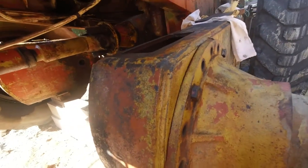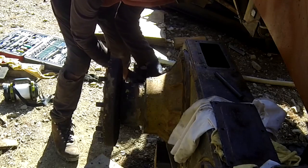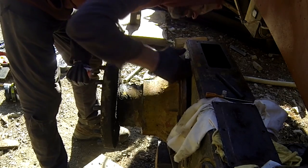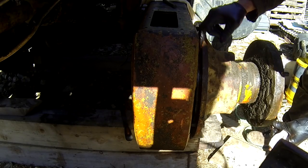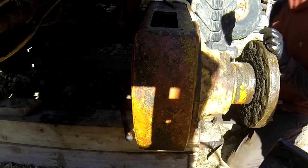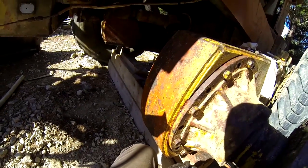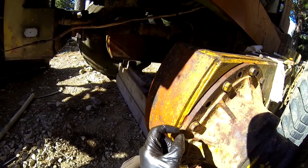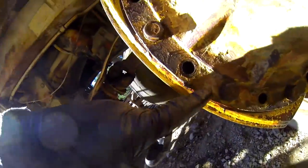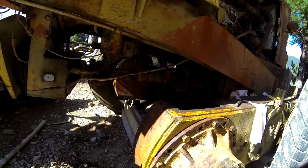All going around pretty well, so I'll back those bolts off, put some sealant around that hub, and then do that back up, because I'm pretty happy with that, I think. Alright, I've snugged all those bolts up. I haven't done them right up to the full torque. I want to let that sealant dry for a few hours, and then I'll torque them up, and that creates a bit of compression in the seal. See that the sealant is squeezed out of all the gaps, so that means it's evenly spread out around the mating surface. I think that'll keep the oil in and the rain out.